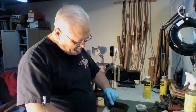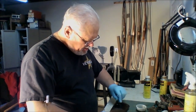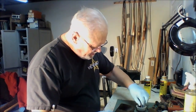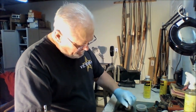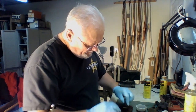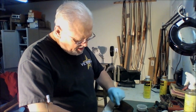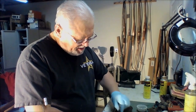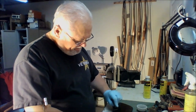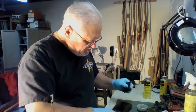The stain and wood dust that we sand off — the sanding dust — stays in the stock as the finish is being absorbed. The idea is to use that sanding dust to fill the pores in the wood so that we end up with a smooth finish with no little pin pricks of pores showing through. So we just proceed along with the stock.